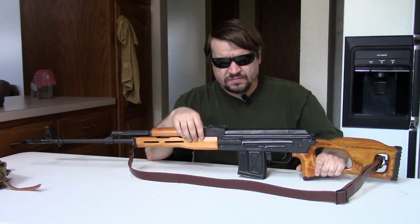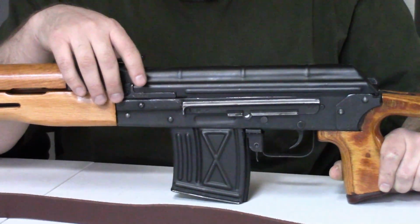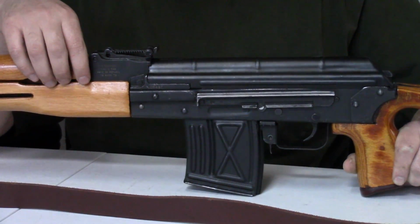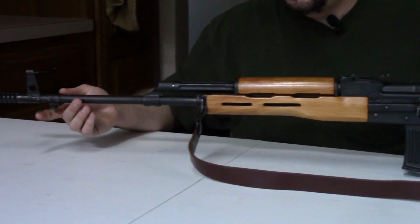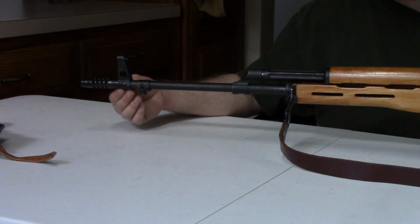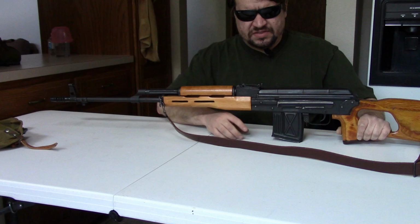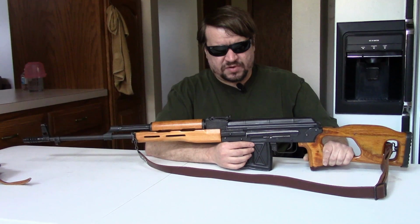There's a few reasons why. First off, the markings are on the sight base here, not on the receiver itself. There's really nothing there on the receiver. Second, the font is Cugir style font here. Serials match. These came in with the bayonet lug lobbed off. Also, most had the muzzle device, either the fixed style, or they had the thread style, but it had a small tack weld on the bottom. And these seem, like I said, to be true imports rebuilt over there at Cugir for our market.